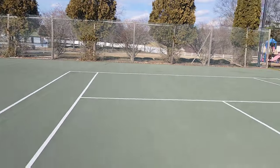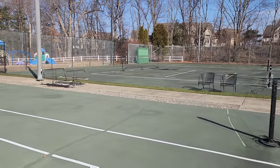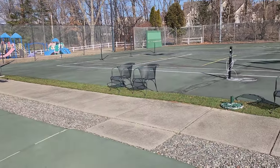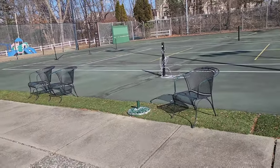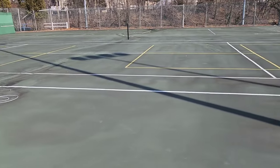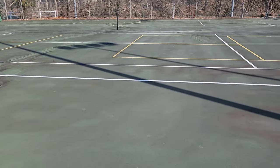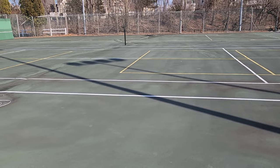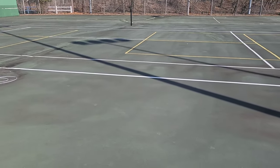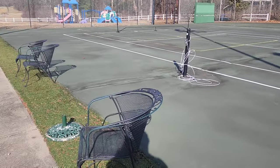Over here, this is where you're talking a lot more money because paving is expensive. A job like this, typically, for pulverizing and paving can be anywhere from $55,000 to $60,000, and for a mill and overlay anywhere from $25,000 to $30,000. If it didn't have the root issues over there, I would absolutely advise them to try to go with a mill and overlay. But you've got root issues, which means you've got base issues, because all that needs to be tightened up.